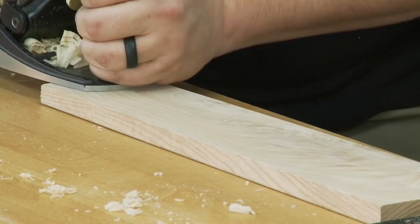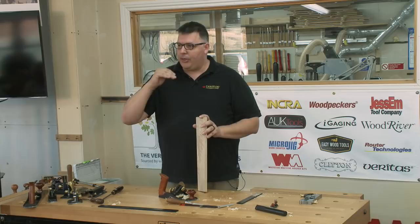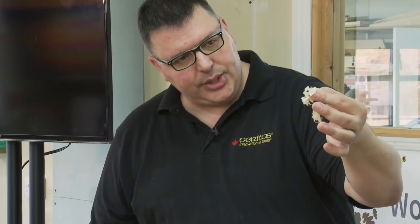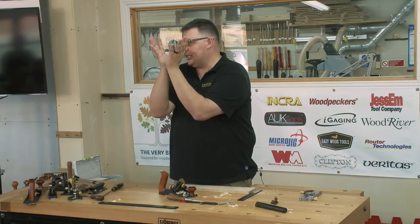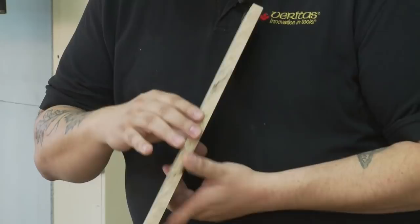With nasty grain like this I'd go the other way. You're never going to get as good a surface with this as with a hand plane — the Japanese taught us that the lower the angle you can work at, the better, because you really shear the wood fibers. But it's still better than sanding. We're getting lovely shavings here, and a lot of them are essentially end-grain shavings because the crotch of the tree runs in all directions. For a scraping plane to scrape across that and produce shavings is really impressive.